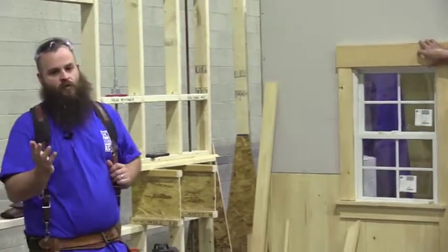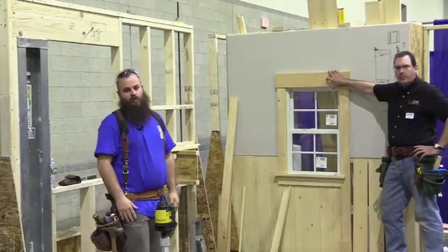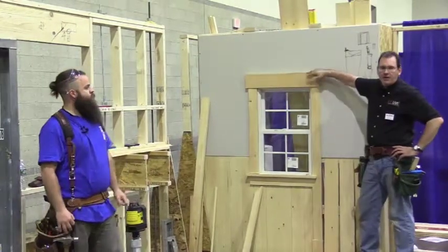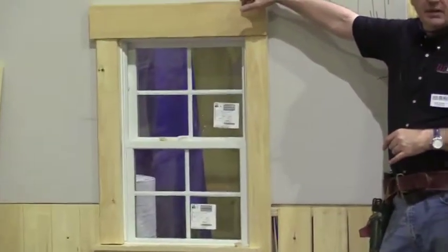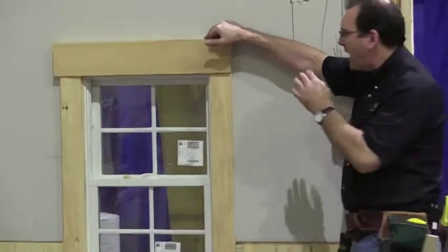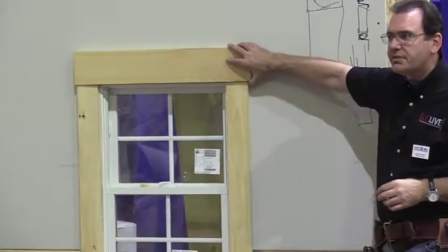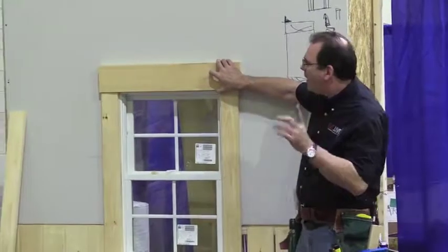It was often half an inch to an inch projection, and this really comes down to the style you're working with. In a New England cottage vernacular, the end projections are smaller. I've seen older homes where it's actually flush - a five-quarter head that's flush on the ends. Whatever style you're working with, a flush joint is difficult because this joint is likely to open up, especially if it's painted, since materials expand and contract at different rates and show as a crack through the paint. That's why shadows and projections add character and charm - and you charge extra for that.